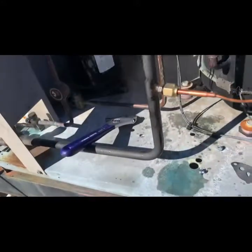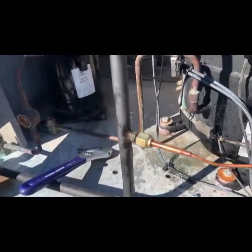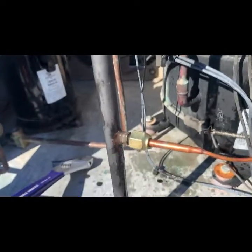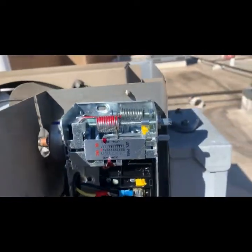There's not a whole lot of pressure on the system at the moment. What I'll do is bring some pressure to the system backwards, just to put a little bit of pressure on that fitting for a first check. With 100 PSI — I'm sealed up. We're good there. I've already got her wired in over here — it's simple, you're just interrupting a leg.